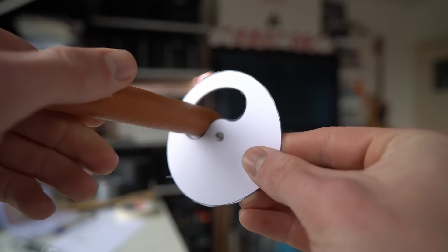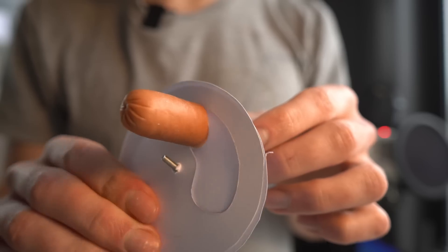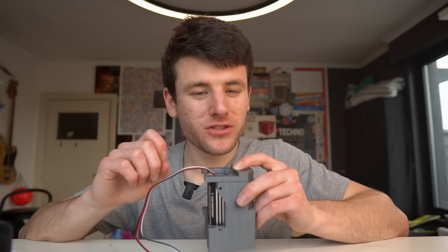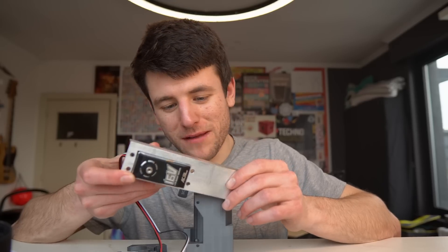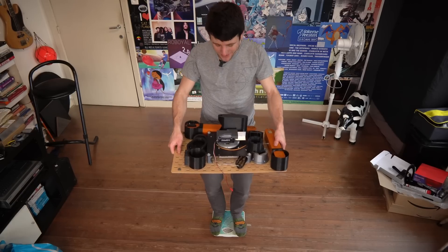I'm going to need to be very careful not to overturn them, because that could create a pretty nasty situation. Speaking of nasty, the overheating plastic sure is. The solution is simple — what do you do when something gets way too hot? You just blow on it, really hard. So I remodeled the base so you can mount a little fan on top, and added room along the servo to allow for more airflow all the way to the bottom. I also made an aluminum bracket to hold the servo in place so it won't move around in the melted plastic anymore.